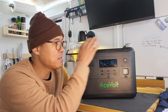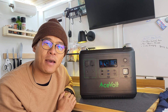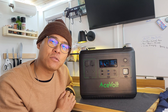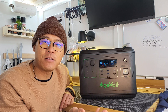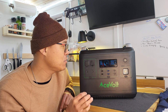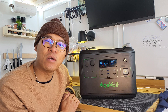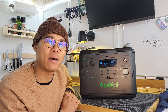There are four fans on either side, and in the month I've had it, I've only heard them turn on once. The inverter is a pure sine wave inverter. For those who don't know the difference: there's nothing wrong with modified sine wave, but high wattage loads or sensitive electronics may have issues with it. This one has a pure sine wave, so you don't have to worry about that.